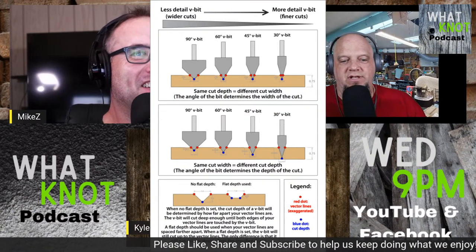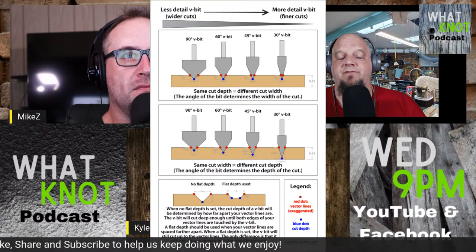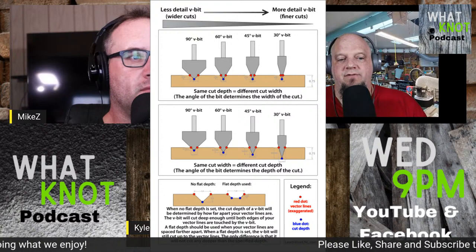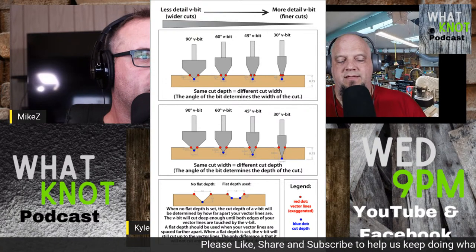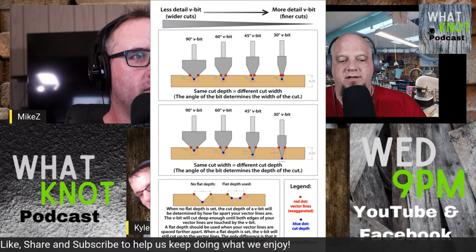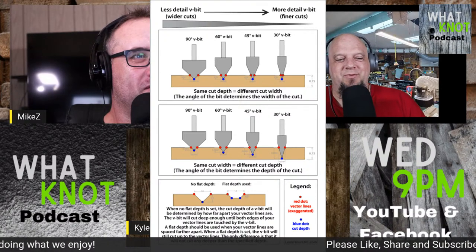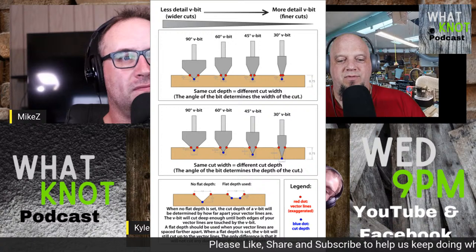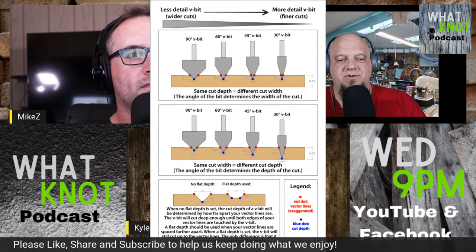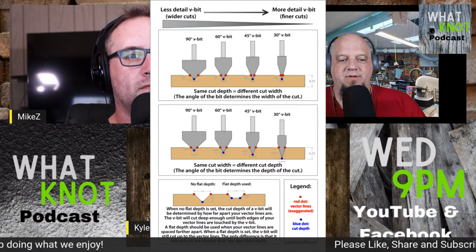This image is a really good discussion point. Both Kyle and I said 60-degree V bit, and there's a reason. If you go with a 90-degree V bit — which is what a lot of people think they want — it has such a wide angle that you don't get a very deep cut. Without that depth, you don't get a lot of detail. So unless you're making big signs for outdoors, the 90-degree sometimes may not be the best option.